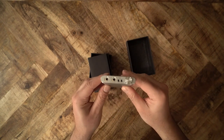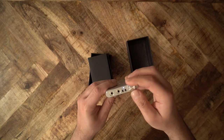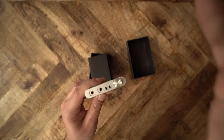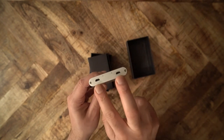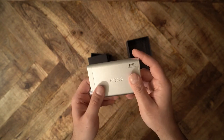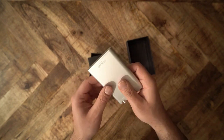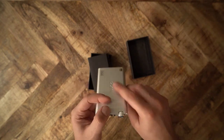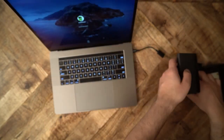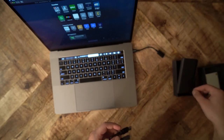In the NX4 unboxing I said I was surprised and impressed with the product's power output — it was able to easily drive headphones up to 300 ohms and had no problem pushing the Mod House Argon on high gain. The Monolith Portable is also powerful, with 47 milliwatts more at 32 ohms than the NX4. Where the NX4 has 293 milliwatts at 32 ohms, the Portable has 340 milliwatts. However, at 300 ohms the Portable provides just 46 milliwatts, while the NX4 offers 114 milliwatts — two and a half times more — which is why the NX4 drives higher impedance headphones so easily.